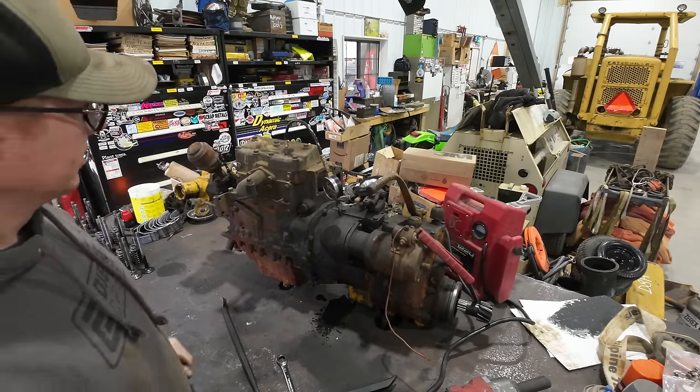Yeah, we got some writing right here, something scribed onto the crankshaft. 1698. Looks like rods have been done 20 over, mains are 20 over, on 1-2 of 73, by somebody with the initials of PC. That's pretty cool. Neat little piece of history there, so stands to reason that the last time this engine was apart was 1973. I could believe that.